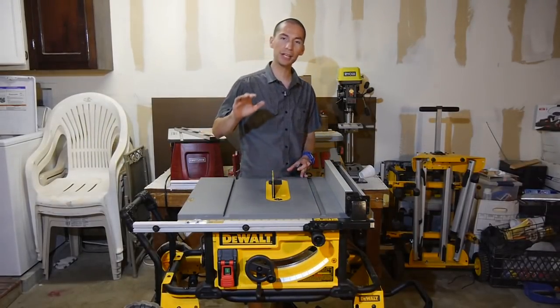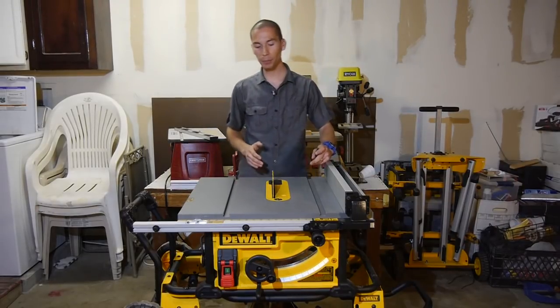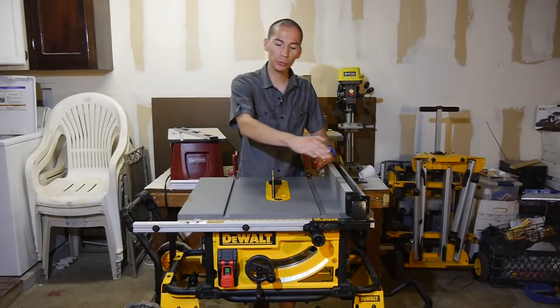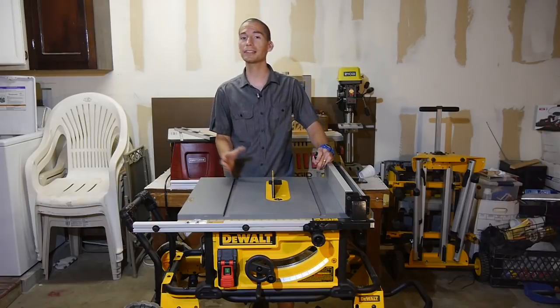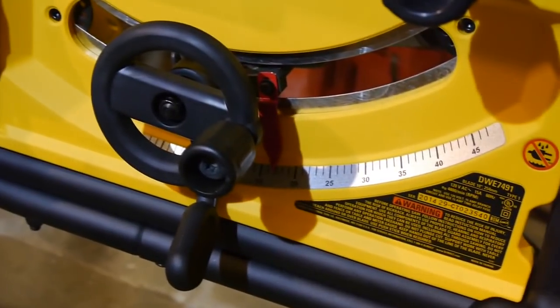If you plan on buying this saw for rough construction work, you don't need to make a single adjustment, except for possibly the riving knife if you experience the same issue on your saw. The built-in rulers were spot on my saw, and if you need exact precision, you might want to check and adjust your fence and also the bevel gauge scale.